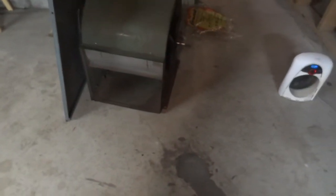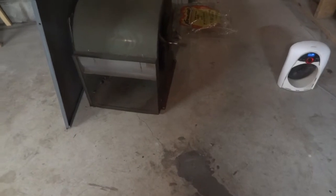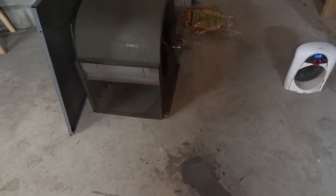Anyways, this was the blower that was in this furnace. And I guess it seized the bearings, and they half tore the motor off it here. So instead of fixing it, they went and got another blower. Right here. See in there? It's hard to see, but the blower is a lot smaller than the hole. So they just put it up against there, and there's a 3-inch gap all the way around that blower sitting on a friggin' piece of wood.